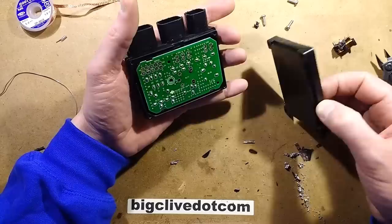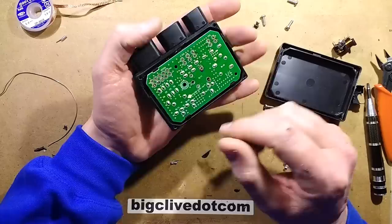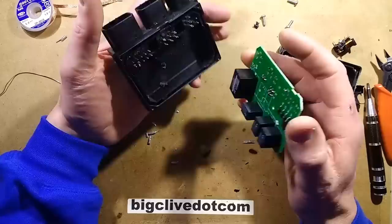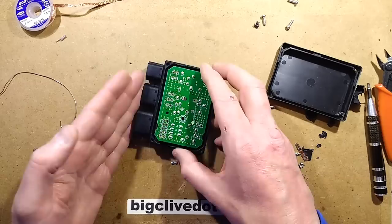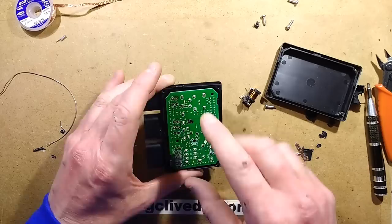You wouldn't be able to get this lid back on again — you'd have to improvise something. It's more of a get-out-of-an-emergency situation type thing. But you could rough up a relay onto that to fix it. Sadly, this thing is just not designed for repair at all, and that's a shame. All they're looking for is financial revenue from selling lots of spares. I'm sure Adrian will be pleased to know that ultimately it was faulty and it wasn't really easy to repair, so his money was justified in getting the new one. Interesting but disappointing — I don't like stuff that's hard to repair. I prefer stuff that is designed with serviceability in mind. Interesting to see inside anyway, particularly given that it is just basically relays and diodes. Very skimpy little relays — they've really cheaped out there a bit.